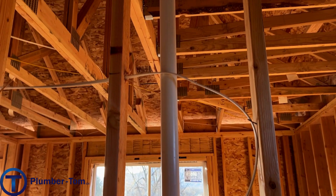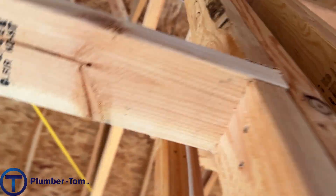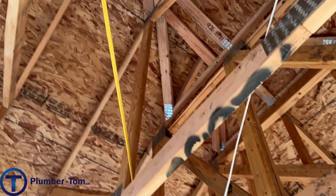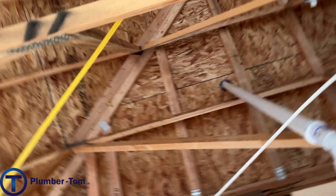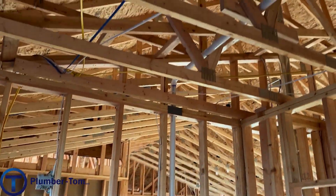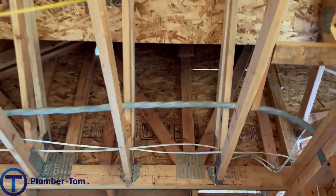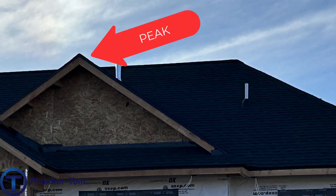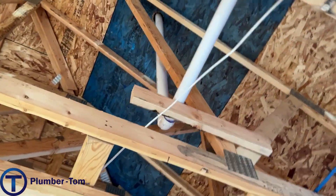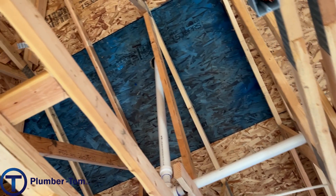Looking at the vents through the roof, this one is headed all the way up. They found good locations away from peaks and valleys — you don't want your plumbing pipe too close to any peaks. They came away from the peak structure and found a nice spot. For the basement vent, rather than shooting straight out the roof where there's an architectural peak, they brought it over and out of the way, then up out the roof far enough away from any of the valleys. Another nice job.